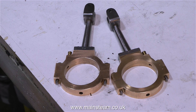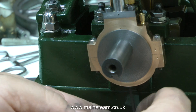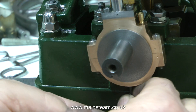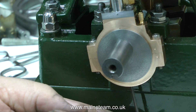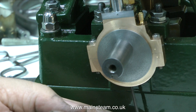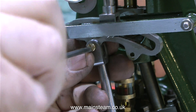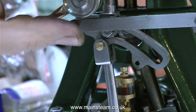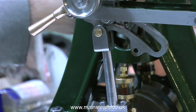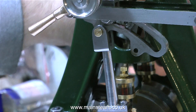So here's the story so far: I have a pair of eccentric straps and some eccentric rods, and now it's time to fit them to the engine. You will notice that the marks I made on the parts are to the inside, so they won't show when the engine's assembled. And now you can see why I drilled the hole in the bottom of the eccentric strap — it makes fitting and adjusting the position of the eccentric sheaves very much easier. I need to make some proper steel pins from some hexagon bar, but as Blackgate's Engineering are currently at an exhibition they probably won't have stock, so as a temporary measure only I'm securing the eccentric rod fork to the expansion link using some brass bolts.